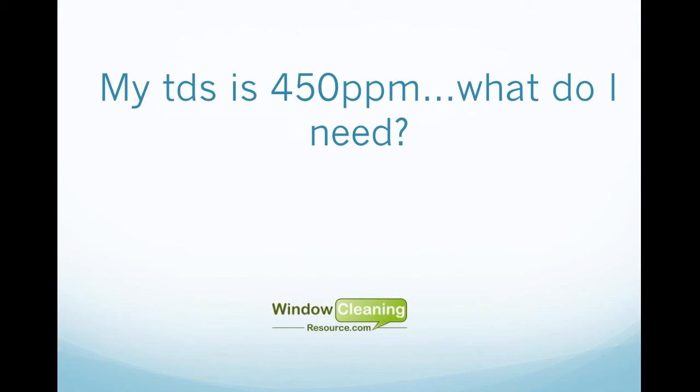I think the rule is, to make pure water at, let's say, 440 TDS, to make pure water with deionization would cost you 12 to 15 cents per gallon. To make pure water with an RO system would cost you 2 to 3 cents a gallon. So it's much cheaper to make pure water with an RO system. But there is a much higher initial investment when you purchase an RO system versus a deionization system.